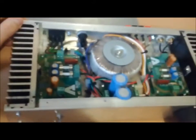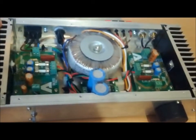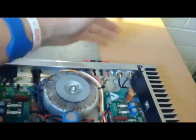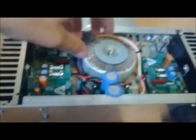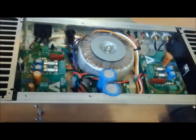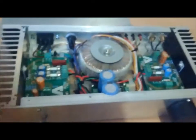Notice also that at the pot up here, the grounds aren't connected between the two channels. So the only place that each of these RCA connectors is grounded is through that input connector on the amplifier module, and then back through wiring, back to ground. Because the whole case is aluminium — not plastic panels or anything — it's got incredibly good RF shielding. I tried it with leads unplugged and with something plugged in but unplugged at the other end. You sit your mobile phone on top of it and call someone — you can't hear it even with your ear right to the speaker and the volume knob turned all the way up, because it's just almost 100% shielding.